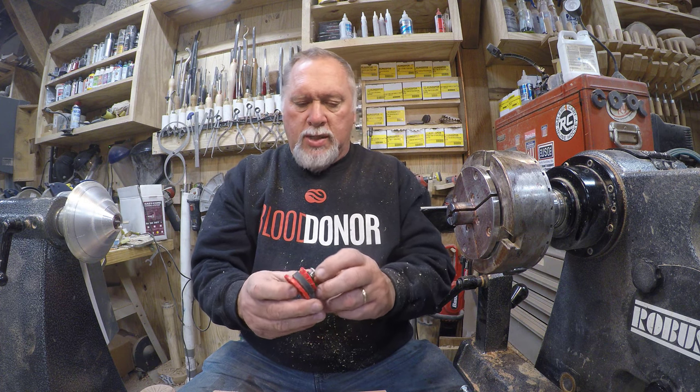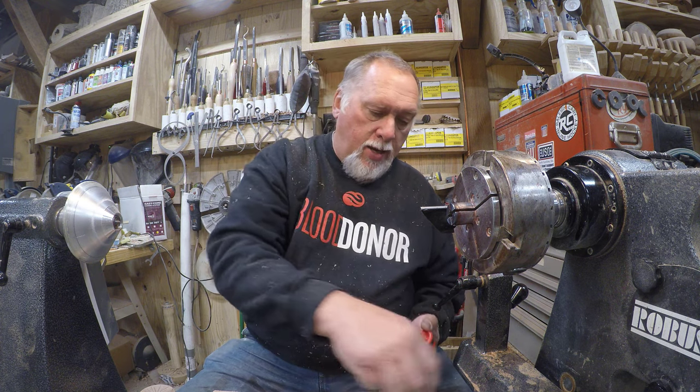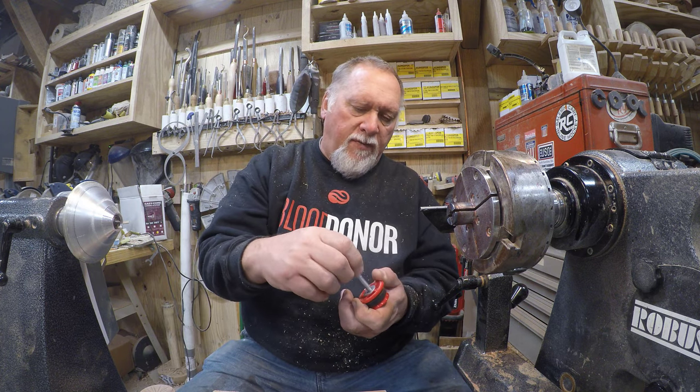They recommend a jam chuck. I work in a facilities position and I work with a lot of plumbers. So I bought a 1.5 inch pipe plug, and I bought extra parts. I took out the existing 2 inch by 5/16 carriage bolt, which is right here, and the wing nut, and I bought a 3 inch, 5/16 carriage bolt and replaced it. And I got myself a 5/16 washer. I'm going to continue using the nylon washer that they have because it makes it easier to turn.